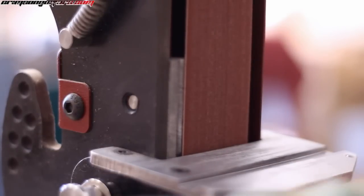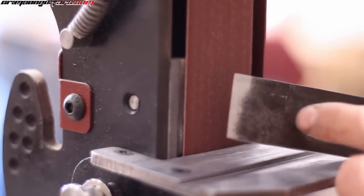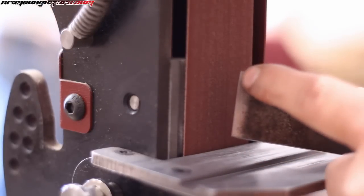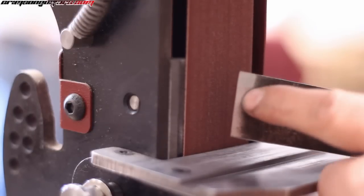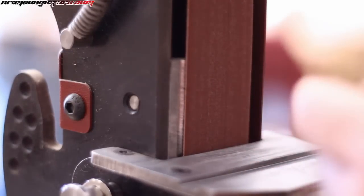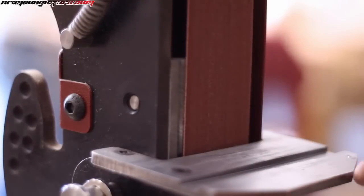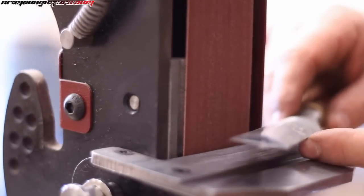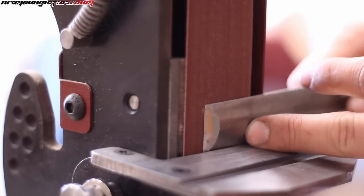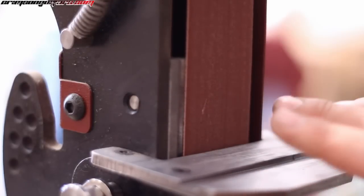In the water, and we're starting to get a surface with which we can work. That's really, really good. A lot of time there will be proper pitting here — and if you've got rust holes in the flat surface of your chisel, when the front edge hits those pits, that will be a massive gouge through your cut and it's just not good enough. I can actually still see a few here, so I'm going to have another go. If you're doing a smaller chisel, be aware it bevels right down to an edge there, and that will actually go in through there — this method will not work on every single tool.